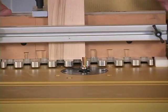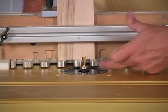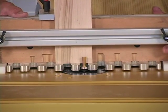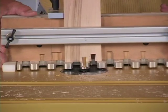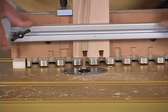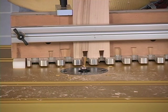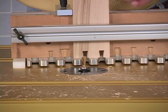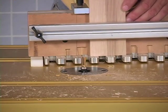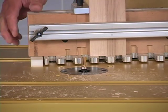All we do is the roller sits right on the table, right like that, and the bearing is going to follow the guides on our dovetail jig. Okay, that side's done. We're doing a pretty narrow drawer, and you always remember the inside of your drawer: the insides of your drawers always go to the inside of the jig, all right? Makes it very simple to use. We'll come into here, cut the dovetails on the other side.